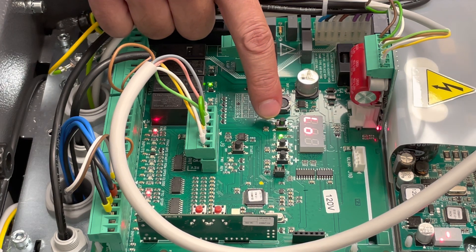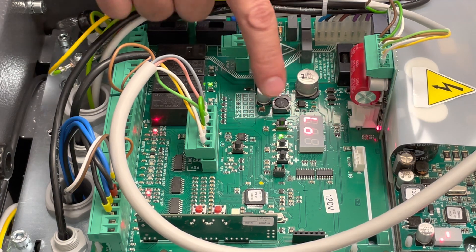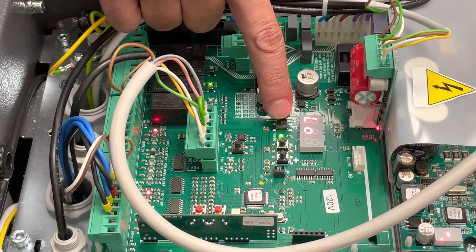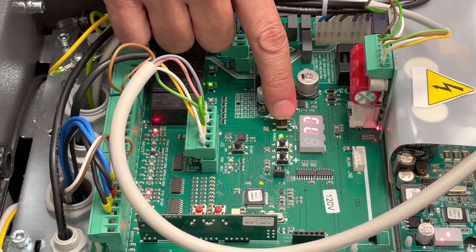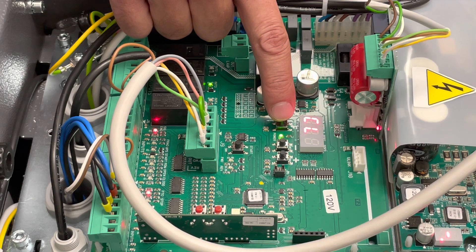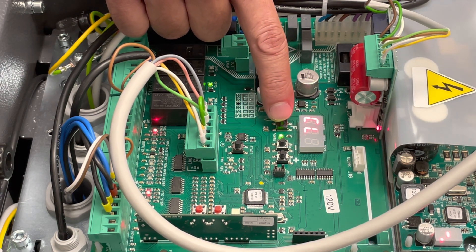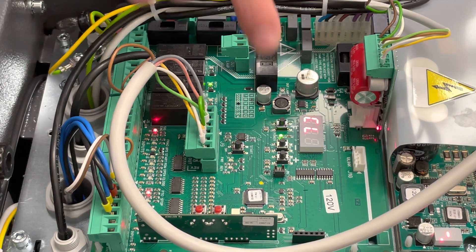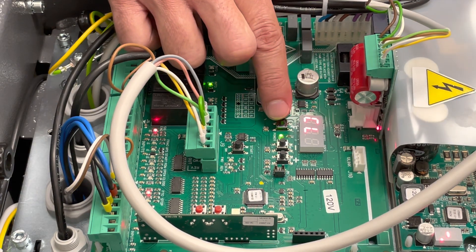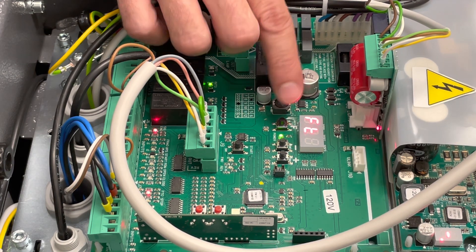LO is used to change it to a dead man switch, make it semi-automatic, or make it automatic. To scroll through the menu, continue hitting F. The next option — which was a lifesaver — I had a customer whose loop detector was not giving a pulse on exit, it would pulse right away every time. In here you can change how your close input works, so you can make it so the gate won't close until the close input goes away and then it'll close.